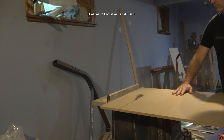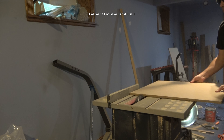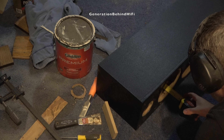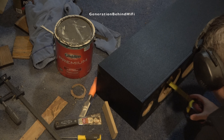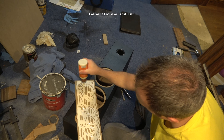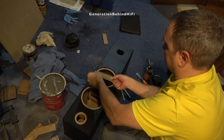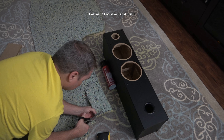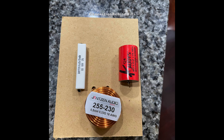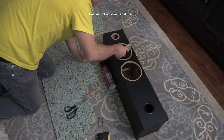For tower speakers priced this low, they seem to offer pretty nice value for money. If you're an avid watcher of my channel, it probably comes as no surprise that I couldn't leave my T652s alone. With every T652 sold, Dayton Audio has included an optional extra credit homework assignment. What I mean by that is, if you want to invest a little time and money, it really isn't that hard to take them to the next level. I know this type of work isn't for everyone, but it is a good way to learn about speaker design techniques. For my T652s I ended up bracing the cabinet and lining the inside walls with carpet padding to help reduce cabinet resonances. To help with sound quality I gave my T652s a proper crossover — I found this crossover design on the internet from someone who was willing to share their expertise with the community. It's people like them that really make this hobby so enjoyable.